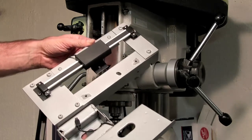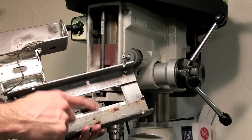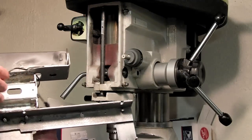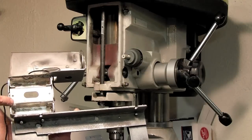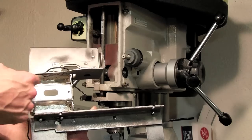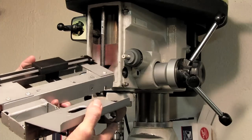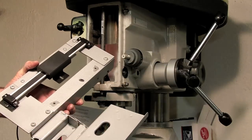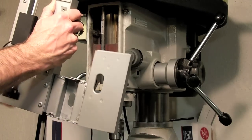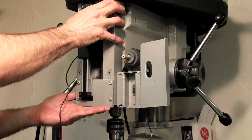This is what I'm going to install now — a part I made out of scrap material. It's basically two pieces of angle iron that go on each side of the machine, mounting to four pre-existing screws where the old cover was. This is a three-and-a-half-inch square piece of galvanized steel meant for attaching a decking stud, with a piece of scrap metal added on top. That's going to hold the displays — they magnetically stick on. The plan is to put all three axes — X, Y, and Z — on this display panel right where I can see them.